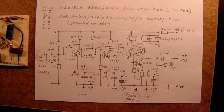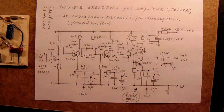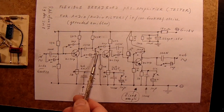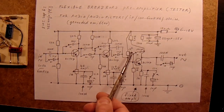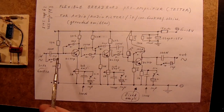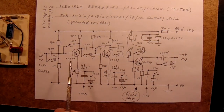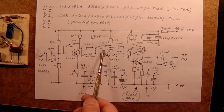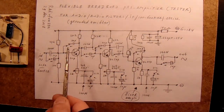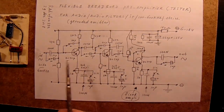Decoupling unit, and it's very important to set the switches to the frequency band where you want to use the circuit. And you can also see here 3 switches, and with that switch you can switch in a 100 picofarad capacitor, and that will damp the frequency band where the transistor circuit works. But for higher frequencies, say you want to connect here a radio coil, you have to open these switches, because otherwise the transistor is much limited in amplifying the higher frequencies.